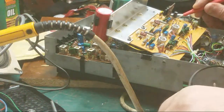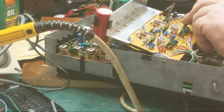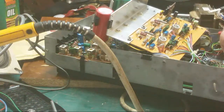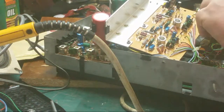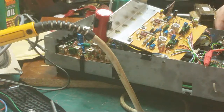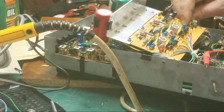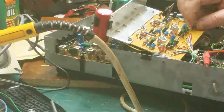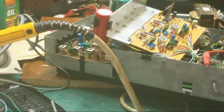That's not what I got. Check it on the diode check. That's okay. Hang on. Well, we found what you smelled anyway. John, I've just found what you smelled. That diode there burnt out, which probably means this is a little regulator circuit here. That regulator could be fucked. Plot thickens.